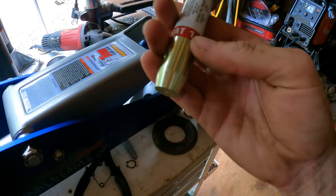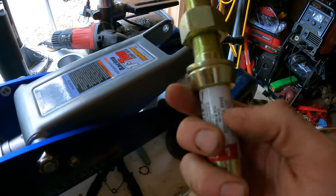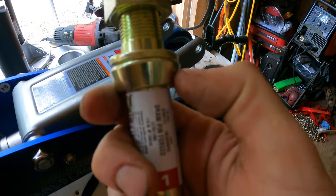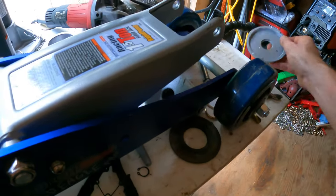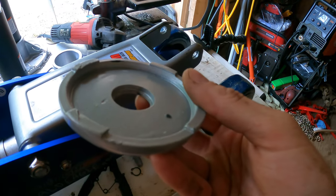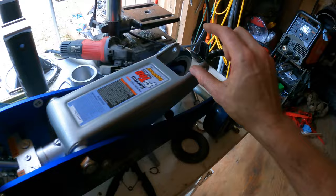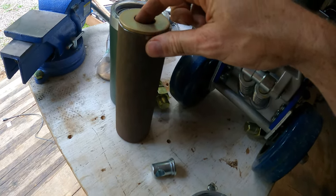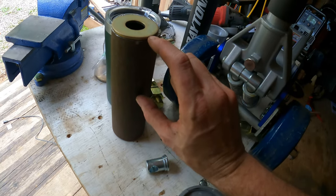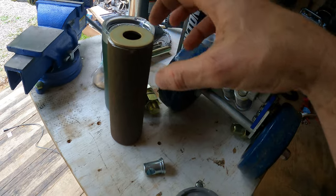The draw pin is gonna pin back on just like normal. I'm gonna cut it off here and then grind it down to fit this thing, and I'll cut a steel pipe for a spacer — I've already got the pipe. I'm gonna weld washers on either end so the pipe won't slide around under there.